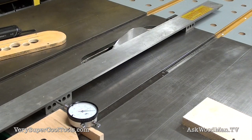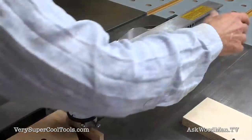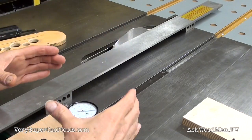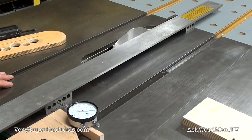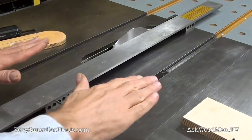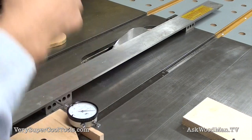So I just took some time this morning to set it back up. The beauty of this style of saw — these cabinet saws — is that there's a cap bolt at all four corners. All you have to do is loosen them up. What's happening is the cabinet base has the trunnion, which is the pivoting and up-and-down mechanism that operates the saw. In these traditional cabinet saws, the trunnion is attached permanently to the cabinet body. The top is what can move in relationship to that fixed system down below.